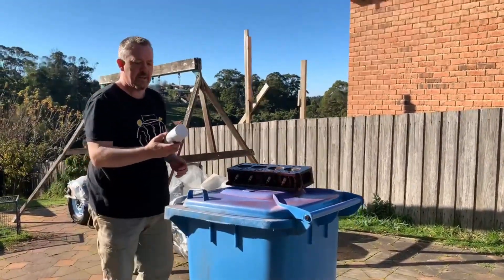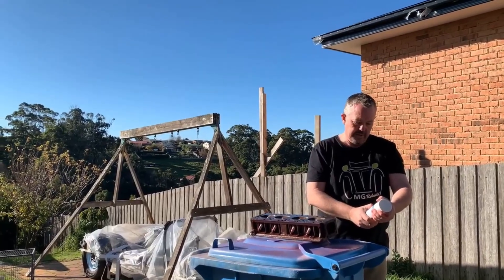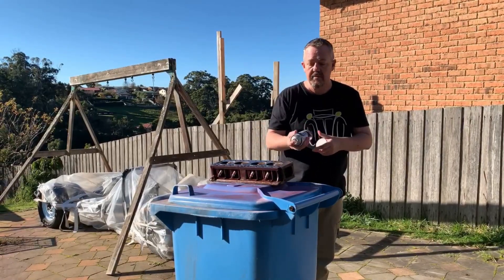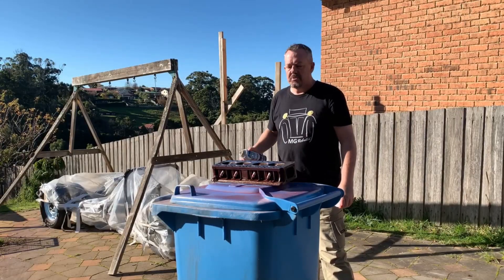The last step is the developer. According to the instructions, spray a light coat on the area and then wait two or three minutes. It will show up any flaws, any cracks, or any problems you might have.